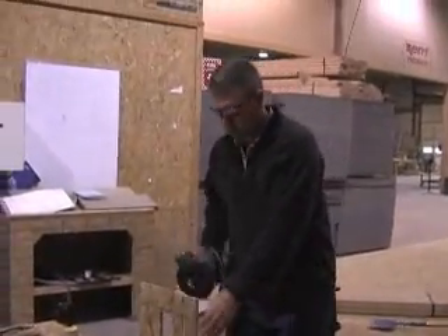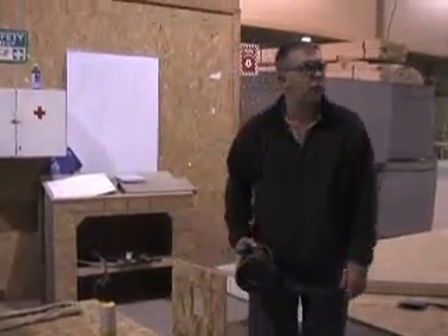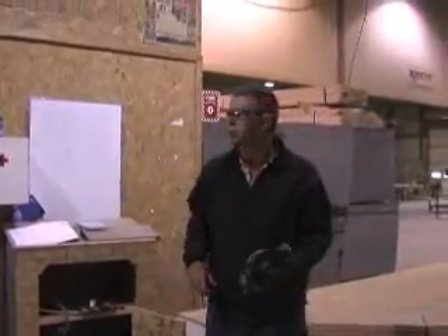On the edge of your template, you run right around and you're cutting out your electrical box just that quick. Once you cut that out, pop it out with your chisel or your screwdriver and you're ready to go.